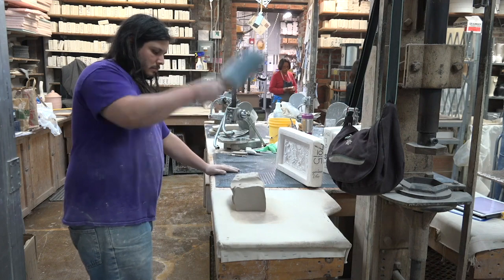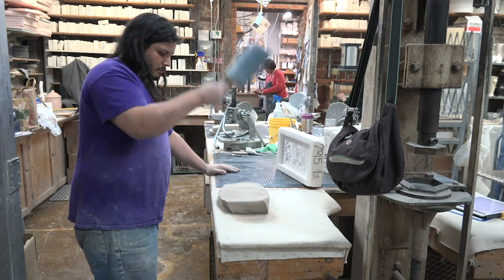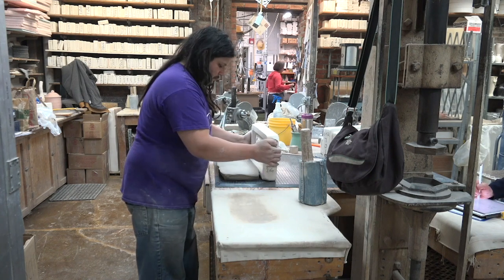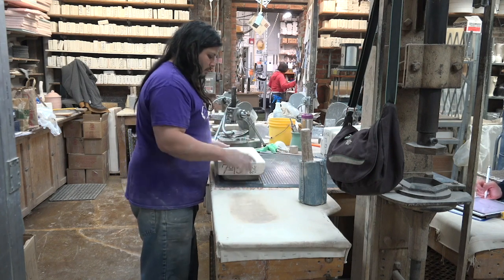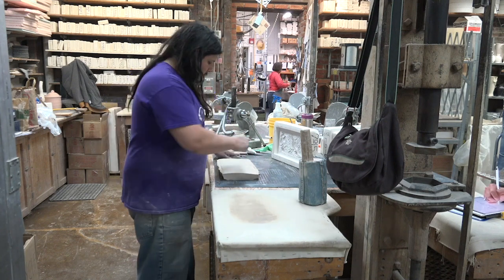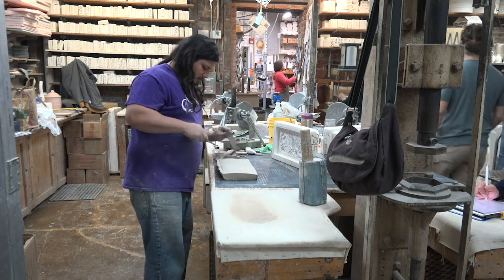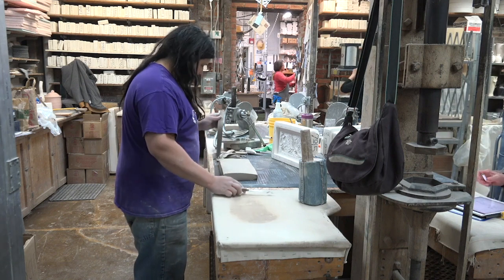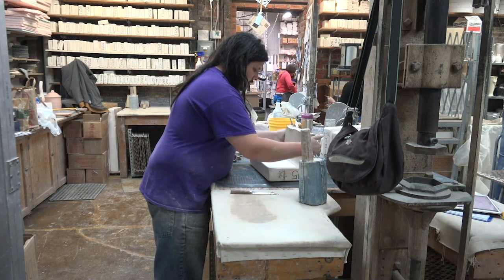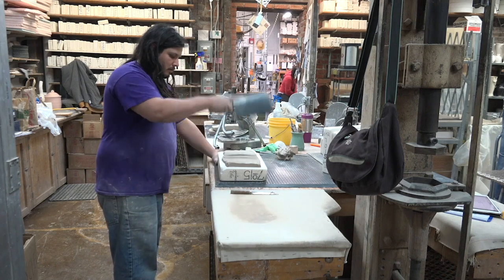The work tasks for the hand pressing clay include: workers first prepare clay by pounding clay with a mallet. Next, they will smooth the tile face using a knife. Next, they position a mold on the clay to determine the size. Then workers will trim all 4 sides of the clay using the knife. Next, they will get the trimmed piece of clay and position the clay in the mold. Workers then pound the clay into the mold.